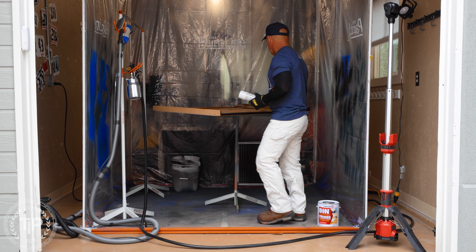If the fisheye is really bad, you definitely want to sand it out, because the circular pattern it leaves — when you re-topcoat it, you will see those circles in the top coat. So you definitely want to sand it out. Right here I'm using my Ecosand 3x4 sander with a half-inch sponge to sand this, and anywhere I see any of the fisheyes that weren't wiped out, I'll definitely want to sand over those and get them taken care of.